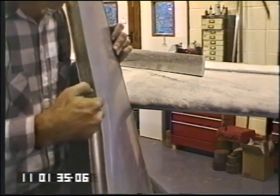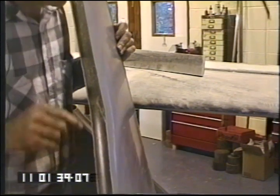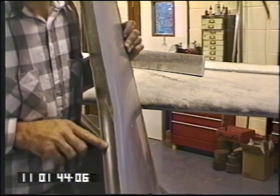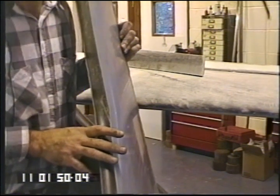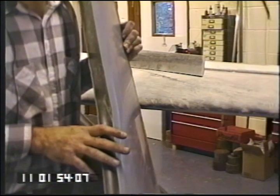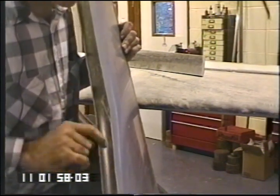Trim to that line. Tuck your blade right in that corner and use it to follow. Don't go below it. This is the portion of your strake — it sets up everything. The whole installation. This is a very large, lifty portion of the wing. It will have an awful lot to do with how your airplane handles in roll at different speeds. So get this right. Trim to that line. Don't exceed it.